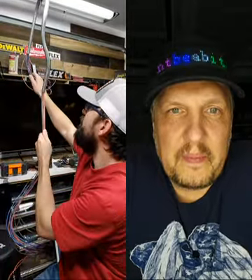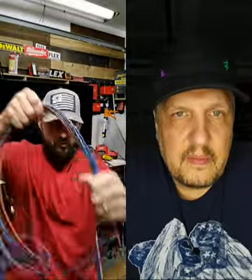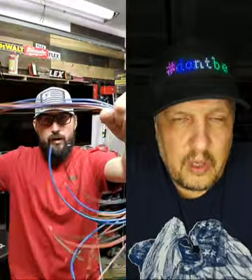Let's get into it — let's pull this out of the conduit. When looking at wire managing, you want to keep it still and one of the best things you can do is hand-over-hand when dealing with wire, absolutely hand over hand. Going hand over hand, it's free to twist. If you've got a helper and they're holding the other side while you're trying to let it twist, just throw your Kleins at them — it has to twist, you know? It's just like an extension cord.